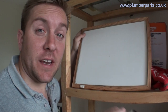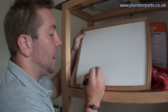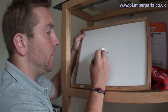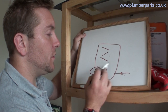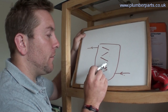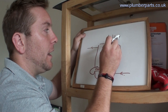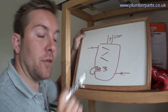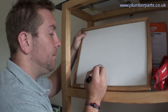Let's take a quick look at a conventional boiler. We have our heat input of 300 degrees at the bottom, our standard baffles, our return coming back from the heating system. That water picks up heat and goes out through the flow. Starting at 300 degrees around here, we lose about 250 degrees off to atmosphere out through the flue.